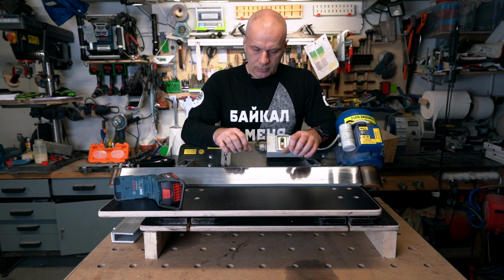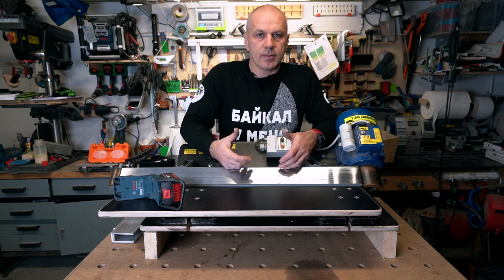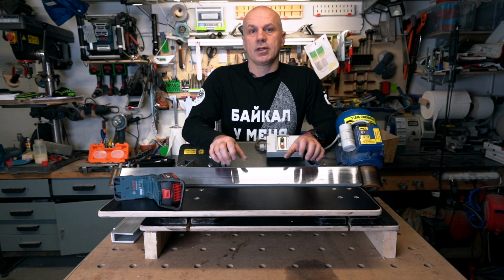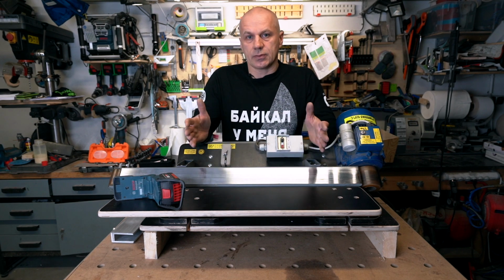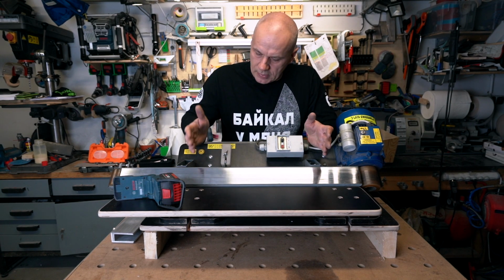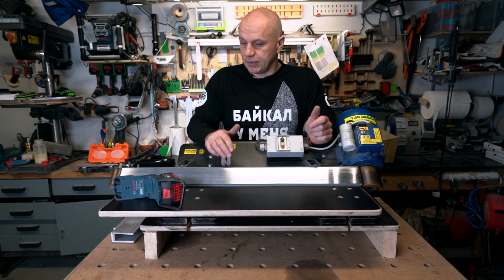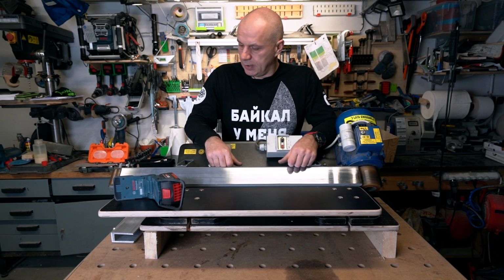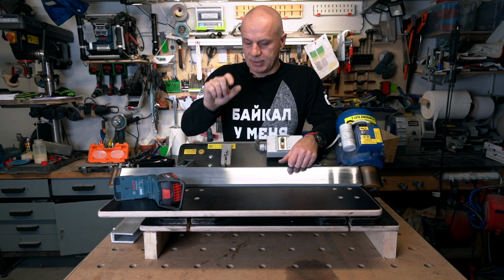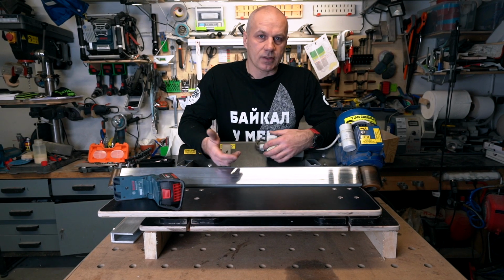it means that your sharpening is in danger, because you may be able to sharpen the runner, but you will not be able to apply a desired profile, so the crown, so to say. So if you plan to make a specific crown on a runner using a surface that is concaved, that will be very, very difficult, very frustrating. It will take a lot of time, and before you realize, your runner height will be significantly reduced,